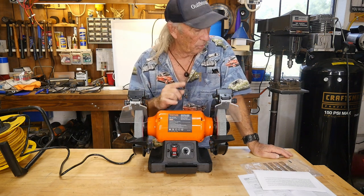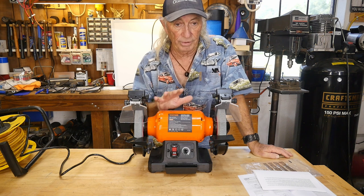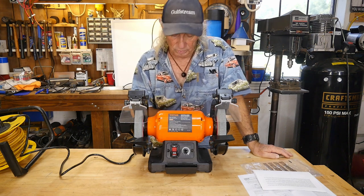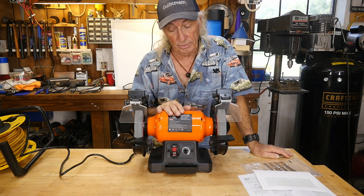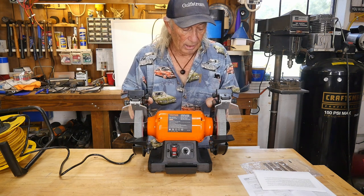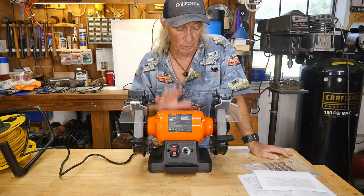I do have a pedestal kit in here for one of these, and you'd have to drill your own holes. It will fit the plate, but there's no access holes in the plate for this particular one. And you can easily use like 3/8 bolts or even looks like almost half inch bolts to tie this guy down. I would say 3/8 would do the trick, but you'd have to drill your own holes. Other features, I don't know. It's supposed to be very quiet, very smooth. It was designed that way, built that way.